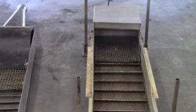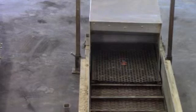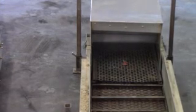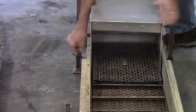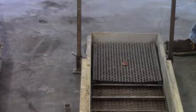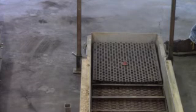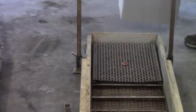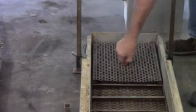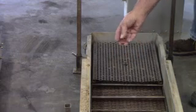Now what I'm going to show you is some of the changes I've made to this box. It's pretty simple. It's a 3/8 punch plate that's inside. I built this crash box, and this is where you hook your hose in. The Gold King used a threaded fitting where you thread your hose into, and this one's just a quicker connect with the T-handle. The next change is I've gone to a 3/8 punch plate, and it is held down with this wing nut that I painted red, obviously, so I don't lose it.